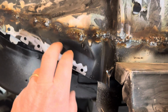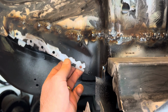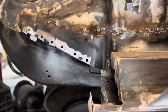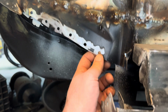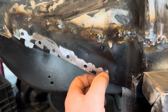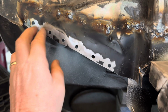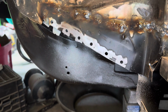And over here, this panel, the aftermarket panels are horrible. They're never going to line up perfect. So I punched my spot weld holes here, or rosette welds, or whatever weld you want to call them. So basically, just at the tip of these circles, I just got to go right where that little black paint is right there. I got to go straight across all the way up and then drill new holes because it's a big gap. So, with that said,